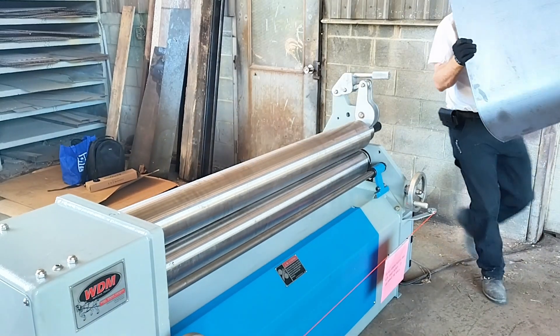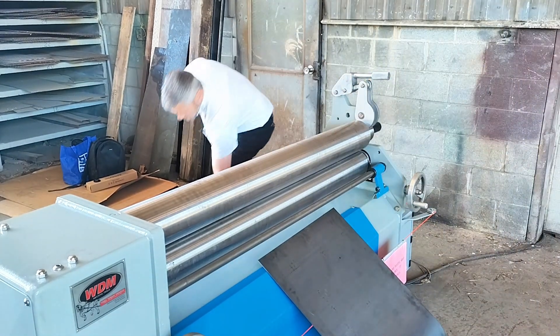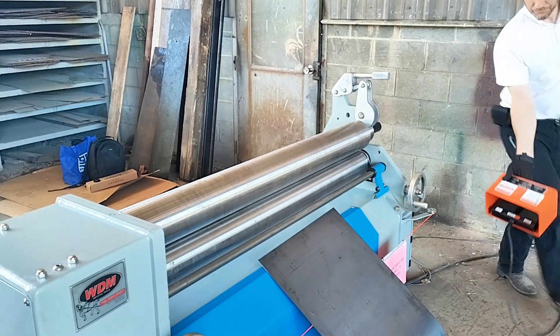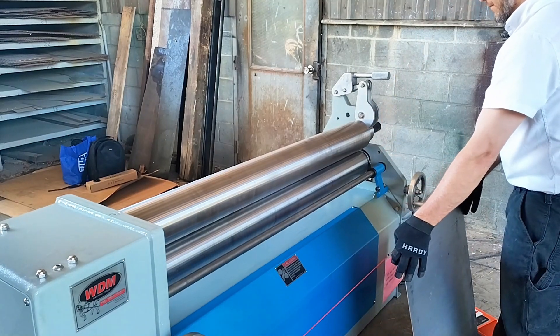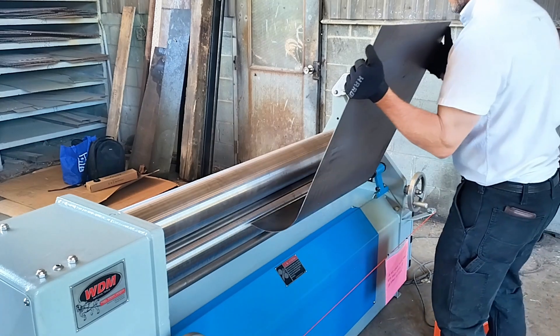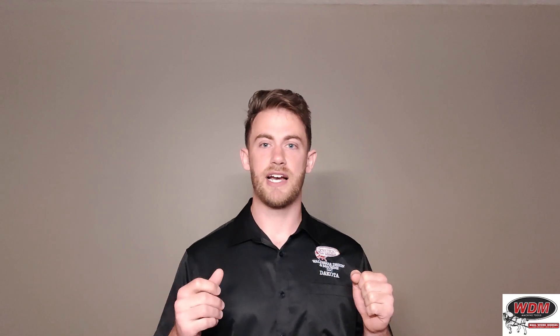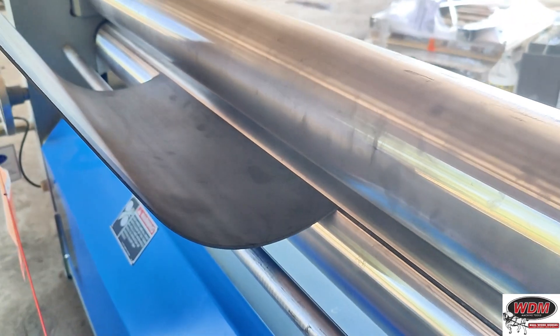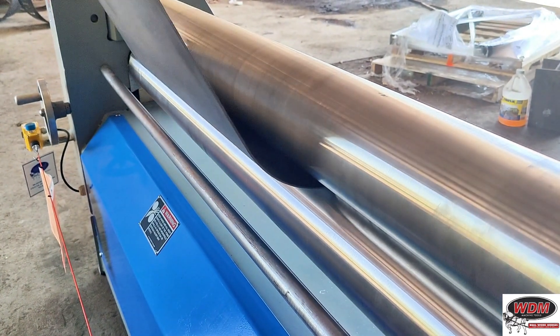Now, take your workpiece out. You don't want to roll it entirely in this method, because it rolls more accurately if you are pushing your material against the roll, instead of doing the bend first and then going through the pinch roll. That's why the pre-bend is only a short movement. Take your workpiece out, bring it around to the front side of the machine — your normal operating side — and lift the pre-bent leading edge up and insert it into the starting groove. Make sure this part is square or it will corkscrew. Make sure it starts square in that starting groove.